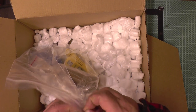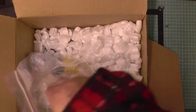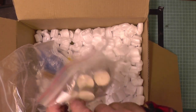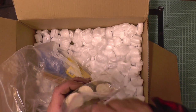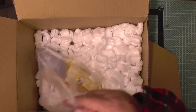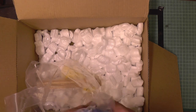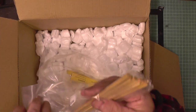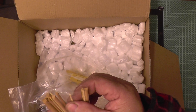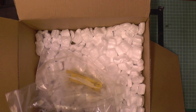I'm all excited. I'm not excited, I can't open the blade bag. I know exactly what that's called. It's called pith wood. The centre of it is very soft and you put pivots in that and it helps you clean the pivots. Thank you very much. And another puffer, to blow the dust away. Some more cocktail sticks, but the proper ones, the peg wood, for cleaning out the pivot holes. Rather than using my lolly sticks, but they'll still get used, my lolly sticks.